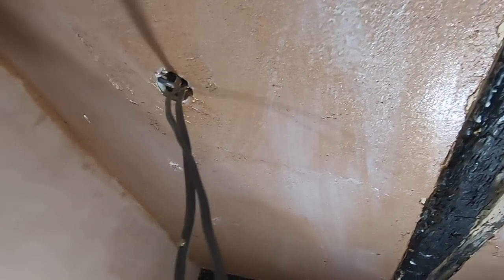It's a very strong mix, as you can see. It's always nice because bonding is very porous. It'll literally suck the moisture out of plaster. So when you're plastering onto bonding, quick note, nice strong mix PVA. It'll keep it at bay. And then if you are beginning or starting out, at least you won't suck in as fast as it would without it. So yeah, I'm going to get a mix on, then I'm going to start plastering it. Let's do it.